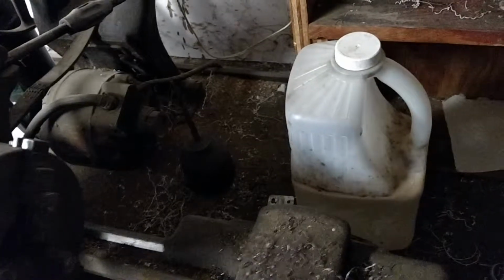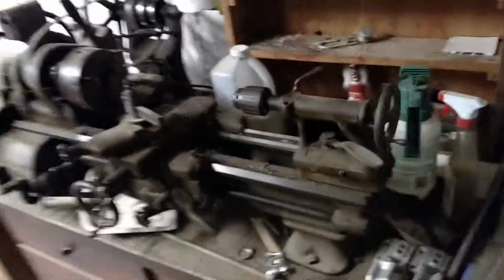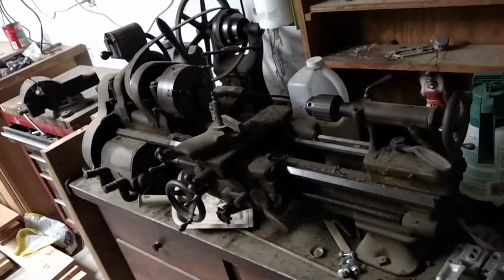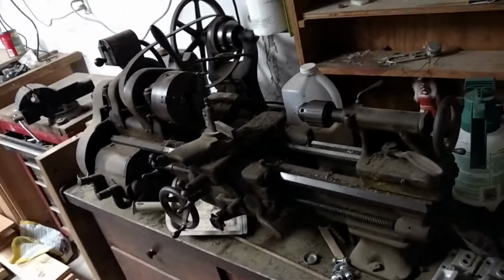So my dad recently used it. Also these smaller, because this one's only a 9-inch. Plastic. A lot of people don't think a lathe will do plastic. You run a real low speed so you don't get hot, so the plastic doesn't melt. You can actually turn down pipe.